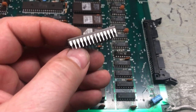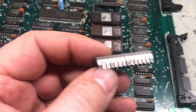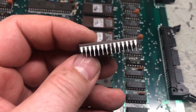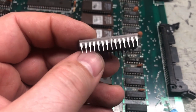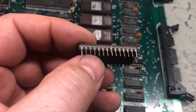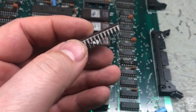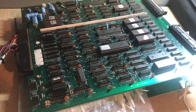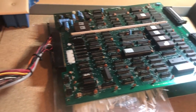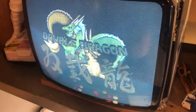I got a new leg successfully installed. I stole it from a spare capacitor — it only needed to be very short. I had to scrape away the old oxidation off the old pin and add some flux to get the solder to stick. I soldered a new leg on there and it's ready to go. Let's get it installed and see what happens.